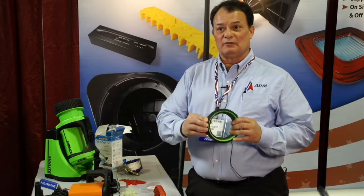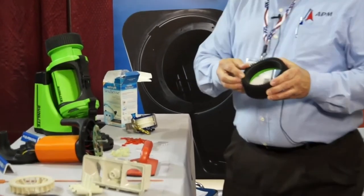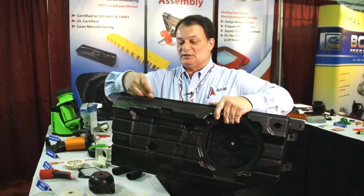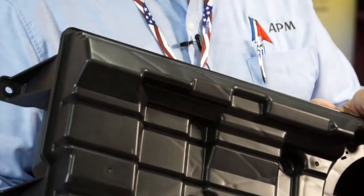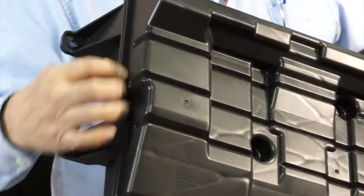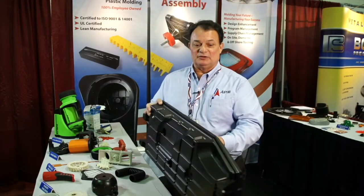This represents injection molding, insert molding, and over-molding of thermoplastic resins and elastomers. This particular part is vibration welded — a process you can use to bond two parts together. The vibration occurs around the perimeter or ring of the part itself. This would be enormous for an ultrasonic welding machine, and you would not get the hermetic seal required to bond the two parts together.